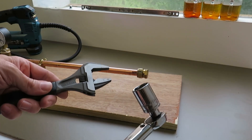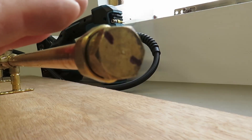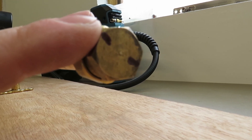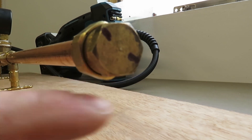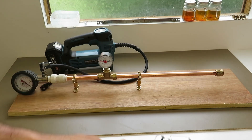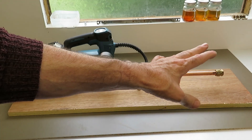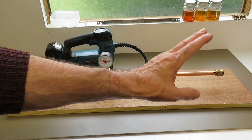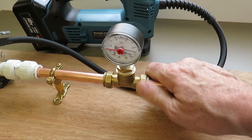Back to the test — I want to see how close to 5 newtons we are with the torque wrench. I still haven't got to 5 newtons, so I'm going to call it: somewhere between 3 and 5 newtons. The cap has actually turned half a turn around the pipe, and that's sufficient to hold back 8 bar pressure. So when it comes to your compression fitting, you don't really need to turn it more than about half a turn from finger tight to make the fitting completely water and air tight. There are also associated problems with over-tightening compression fittings.